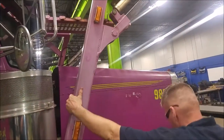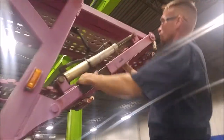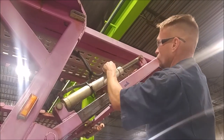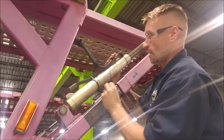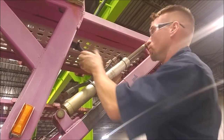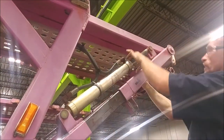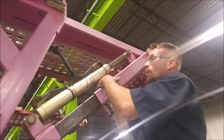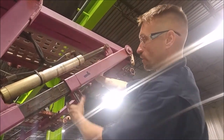Climbing up a little bit here to look at the cylinder and make sure there are no leaks out of the fittings. These are a little on the rusty side — it would be a good idea to take a wire brush to them and give them a little bit of paint. One zip tie here is broken, and another isn't moving very well. This cylinder is in a good spot overall, but looking at the ramrod, there's a little bit of excess oil, which means the bore ring right here is starting to wear. So that cylinder needs a rebuild.